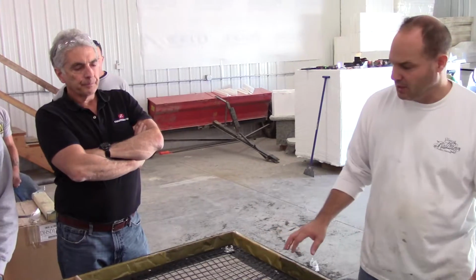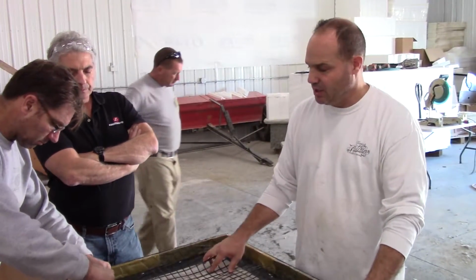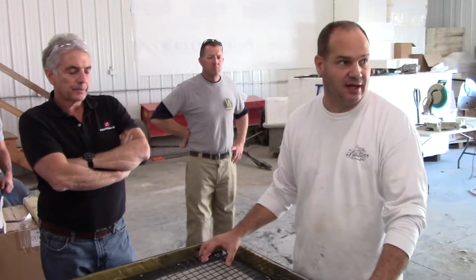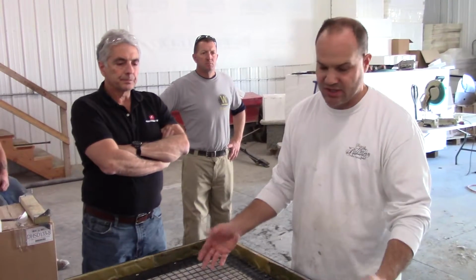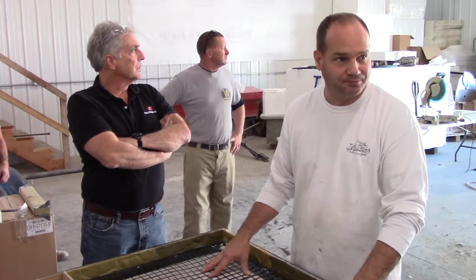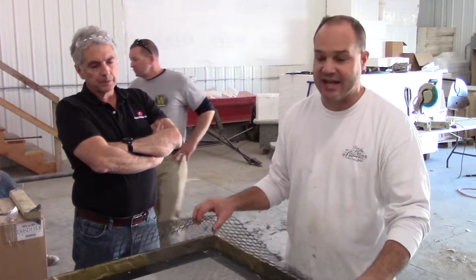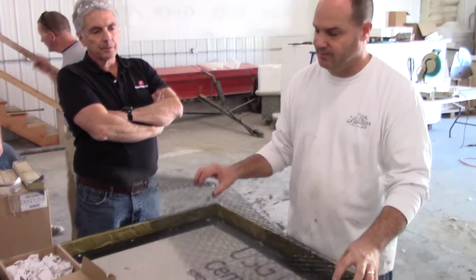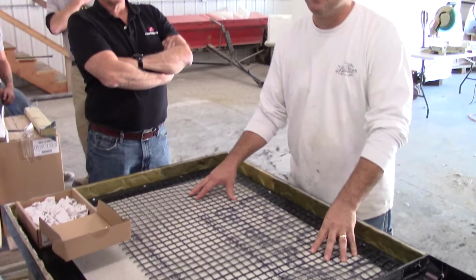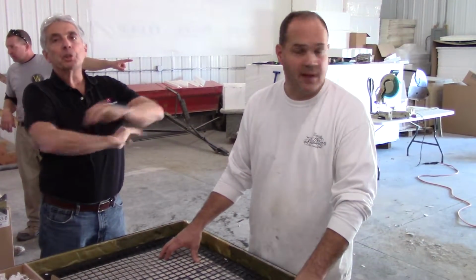is the way to go. It doesn't cost that much more money to upgrade to that, and unlike steel or metal, the concrete actually bonds to this stuff, and this just gives us the added protection against fractures and cracks. I've used this particular size of a fiberglass lath, and I've done lengths over 30 feet long, and I've yet to have a crack. So that's impressive. So use it.